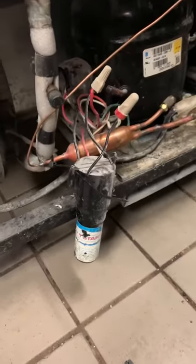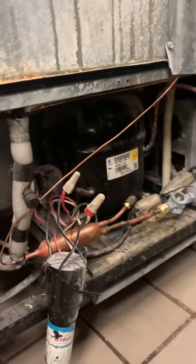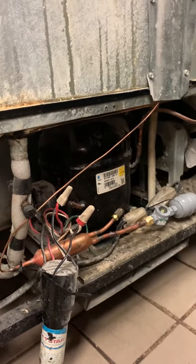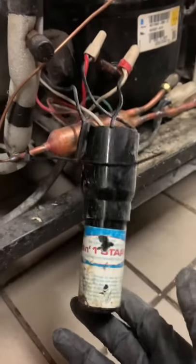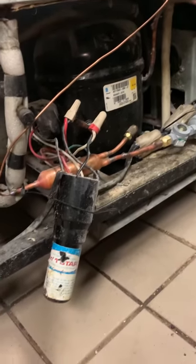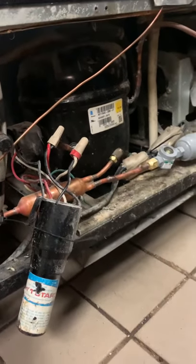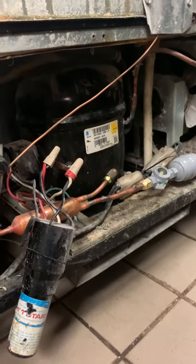How you doing guys, this is Joe with LVV. We're here on a Bamer recall — the compressor is humming and shutting off a lot because the capacitor is no good and it can't start the compressor up, then it drops out with the relay. So obviously that has probably happened before. They put a three-in-one in. I don't have the OEM parts, so we'll probably do the same thing. This might be failed, so I'll start her up and show you what sounds it's making — diagnosis first.